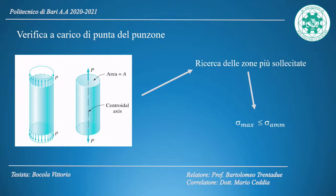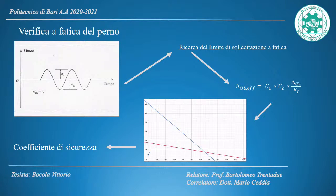Stress analysis verified the most loaded cross-sections of the hollow punch and stylus. Maximum stress occurs in the hollow section; being subject only to compression, a buckling check was performed using the omega method and Eulerian load concepts. For the pin, a section variation was adopted to accommodate the wheels. Fatigue of the material was studied; with no torsional moment, the mean stress is zero and the fatigue cycle is fully reversed symmetric. The fatigue stress limit was defined and the most stressed sections were verified via the Haigh diagram with the corresponding safety coefficient.